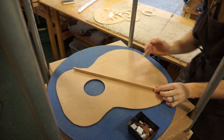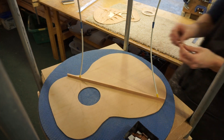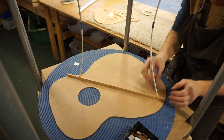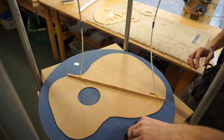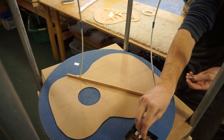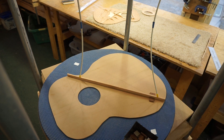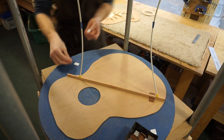The way I use these is while I'm dry-fitting the braces — there's no glue on this now — I can position these braces one by one as I go, and to hold their position I peel the backing off and just place four spacers on each brace. I butt it up nice and firmly against the brace so it creates a channel the exact width of the brace for it to just click back into place.